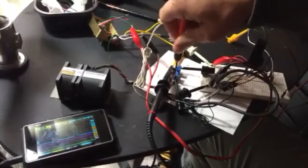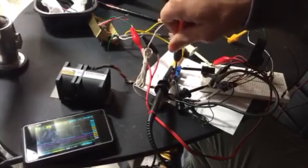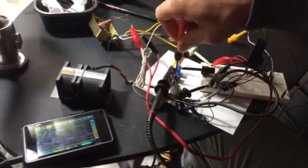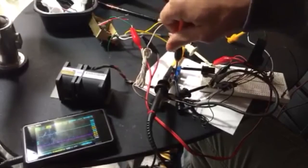Here is some testing I was doing on a protoboard, adjusting the pulse width modulation as seen on the oscilloscope on the left. Here I'm adjusting the duty cycle and looking at it through an oscilloscope, making sure it's at 50%.